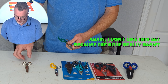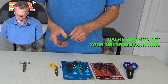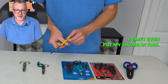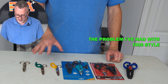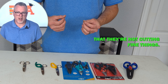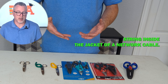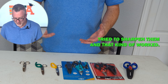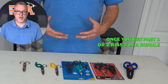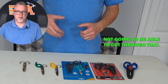I don't like this set because the thumb hole really hasn't improved any, so you're still going to have the same problem — if you use your thumb you're going to get it stuck. This set has the same principle; ironically the thumb hole is almost useless, I can't even put my thumb in it. The problem I've had with this style is that eventually the blades get so dull they're not cutting fine things like a pull string or the tension string inside the jacket of a network cable. I bought a sharpener, tried to sharpen them — that kind of worked, kind of didn't. The other problem is you really can't cut anything very thick; once you get past one or two RJ45s in a bundle or a slightly thicker ground cable, even with the leverage you're not going to be able to cut through that.